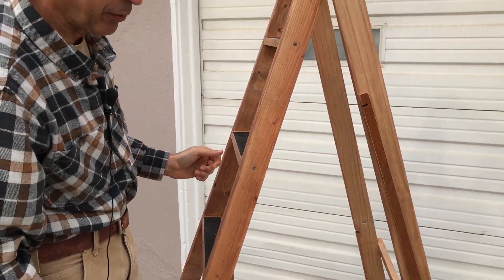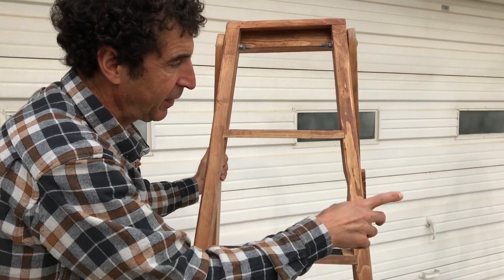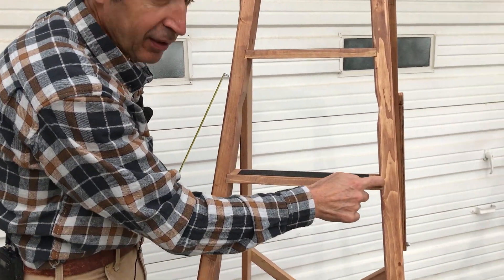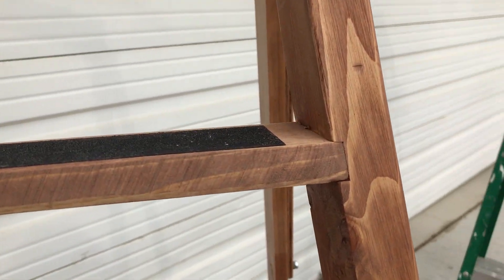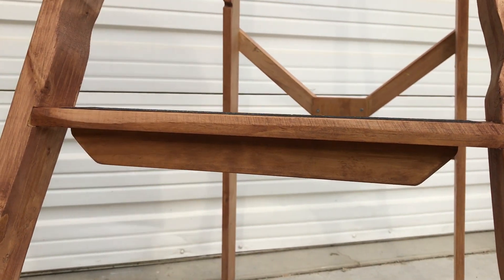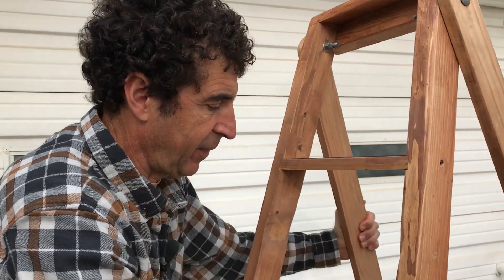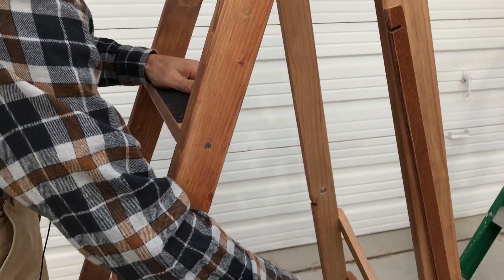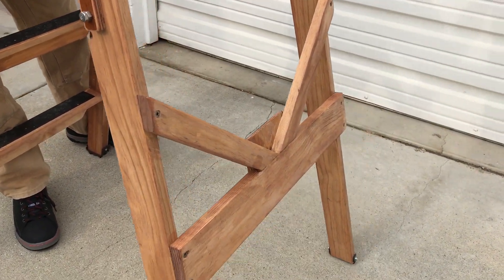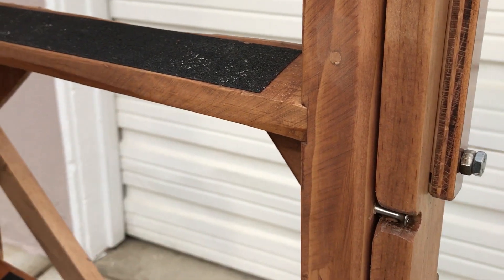I built it straightforwardly out of wood, which I'm more comfortable working with. I followed the same angles as that commercial ladder — it's about a five-degree angle here. I routed out that area for a little strength, and on the lower rungs which are wider, I put a piece of wood to add strength, and I glued and screwed everything together. I also had to put bracing on the outside so it would clear when I fold it — these nest in here — and I had to router out for this screw as well.